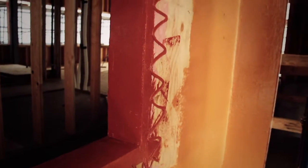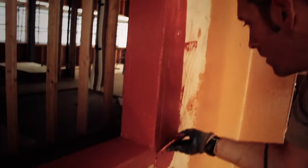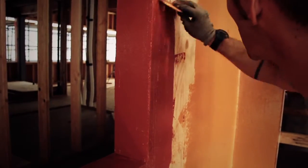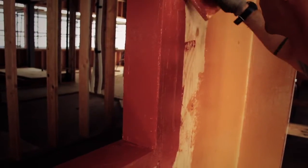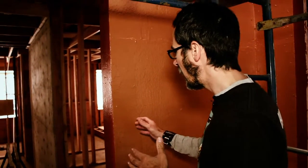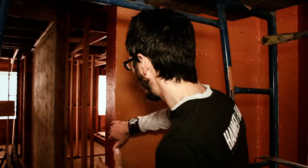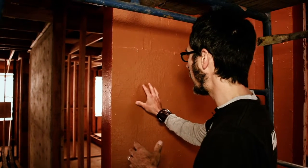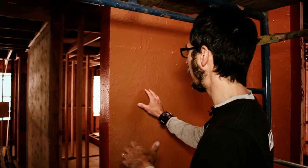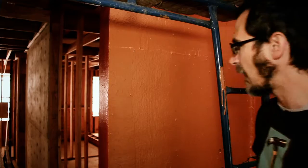The reason for the coverage width is that if you do get wind-driven rain, if your Tyvek paper comes out this far, it's not going to go twelve inches in — per their studies, it comes in about eight inches or so and then drains down the face. The general rule of thumb with all Fast Flash products is you have the right application when you can't see through it. When you start with joint seam filler, then apply Fast Flash — as long as you can't see the last product you applied, you're good. As long as you cannot see the product underneath, you have the right thickness of application.